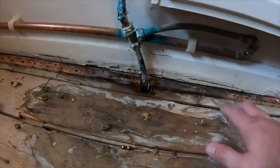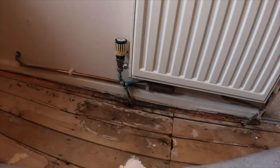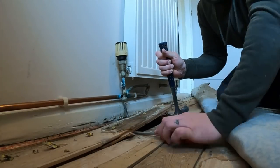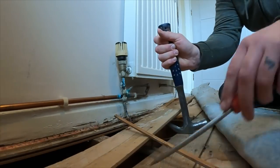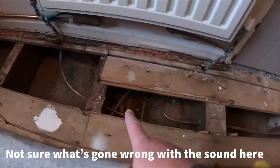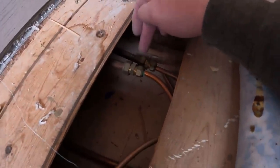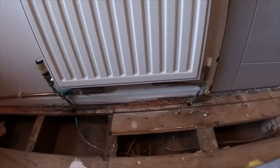We just pulled this carpet back and it looks like it's been leaking a while. I'm surprised they haven't rung me before, showing water stains underneath. But at least we've got some boards here — we'll whip these up and see what we're up against. That's the floor up there. You can see the 10mm coming in. Same as this one — it's got a jointer there. But it's going all the way down to these two reducers. So what I'm going to do is bung it — whip these off, put caps on there and then get rid of these two valves.